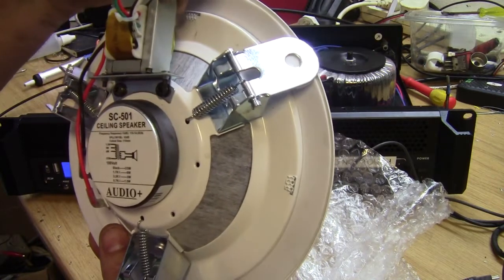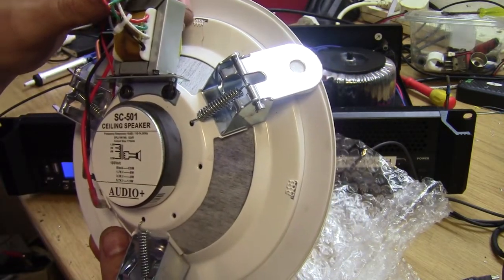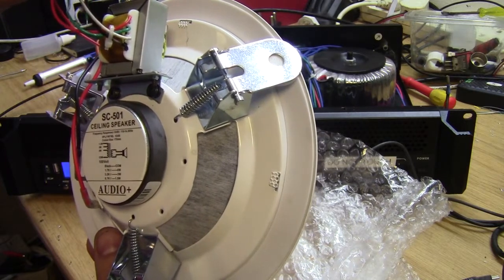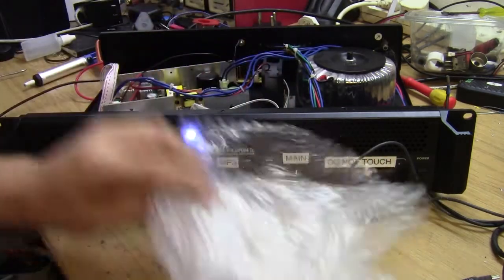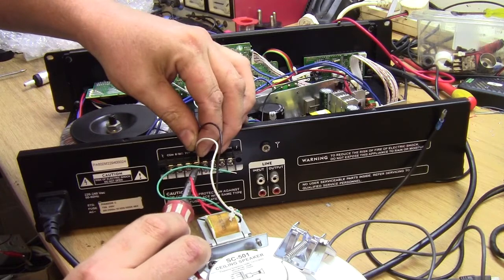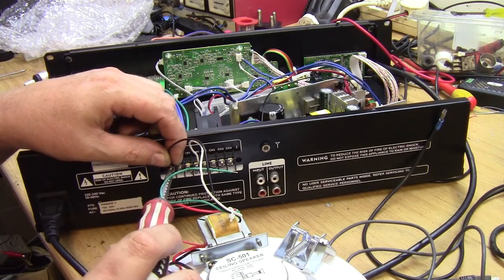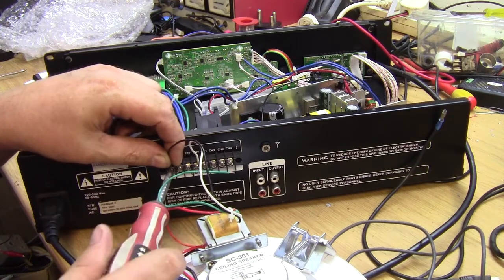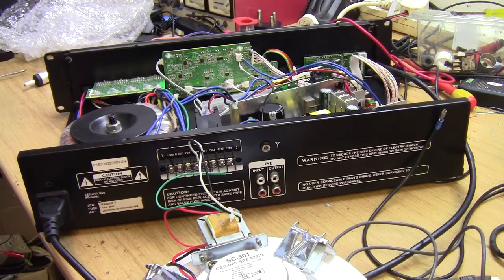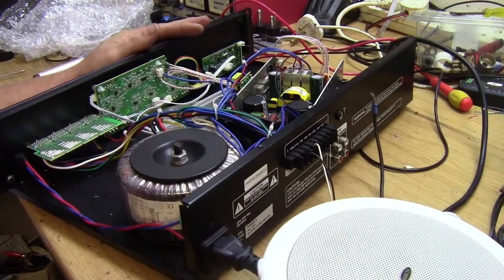Over here I've got a speaker that goes with these PA systems. It has a normal speaker with a little transformer and you can choose different taps. If I choose black and 1.7K, that should give us 6 watts. The reason they use 70 or 100 volt lines for speakers that are far apart is because of the higher voltage — for the same power you use a lower current. The longer your line is, the more resistance, and the higher the current draw, the more voltage drop you get. By running 100 volts you can run a lot of speakers together as long as they don't exceed the amplifier's rating, and they can be far apart.